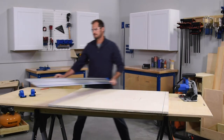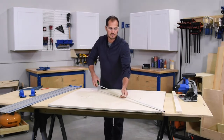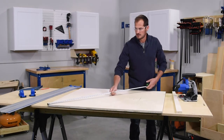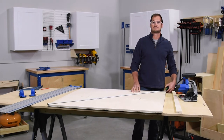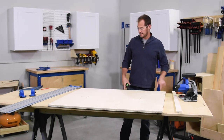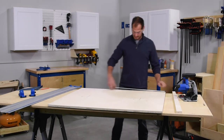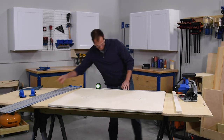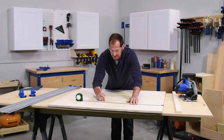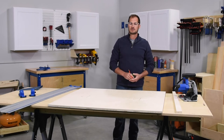After removing my track, this edge is now square with the rest of my board. Taking the diagonal measurements again — 61 and 7/8 and 61 and 7/8 — they match. Now I need to cut this to size. I have my square reference edge and the one I just cut. It's as simple as drawing a pencil line at 24 inches, marking it again at 24 inches on the other end, laying the track along those two marks, and I have a perfectly square 24-inch board.